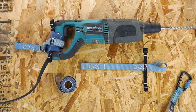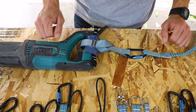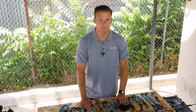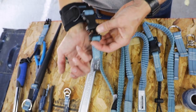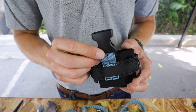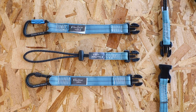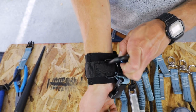For larger and heavier hand or power tools, our loop end attachment utilizes a combined choke-on and tape fastening for tools weighing up to 35 pounds. If you're thinking all these tethers are just going to slow you down, check out our new flexible neoprene wrist attachment anchor, which is convenient for close proximity work. It allows you to quickly connect and disconnect your tools using the large speed clip receiver for compatible speed clip tool attachments. The wrist anchor also has a D-ring, allowing for multi-tool connection to increase productivity.